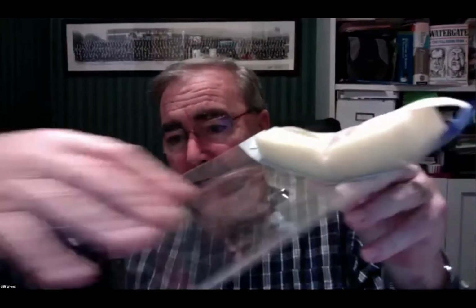What I've recently done is I've taken one of these and taken the top off and fixed this bit to the funnel opening of my pipe, which is hovering underneath where the chuck is. So my dust falls onto this and then gets sort of fed into the pipe, and that's working quite well at the moment. Good idea. Yeah, well, if you can see the visible dust going into the pipe, then you could hope that the fine dust, which is the actual dangerous part, is going as well.